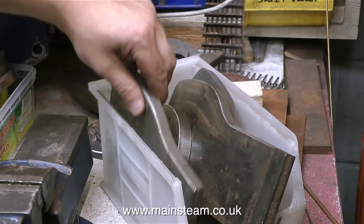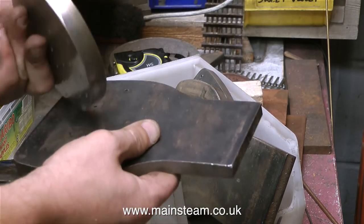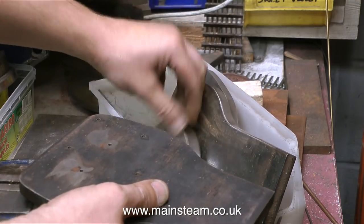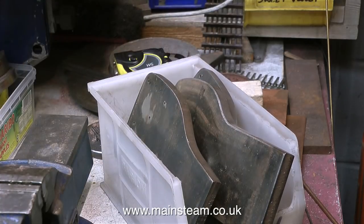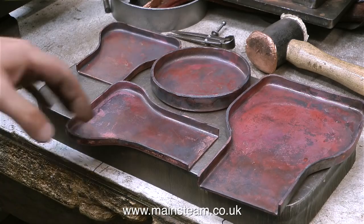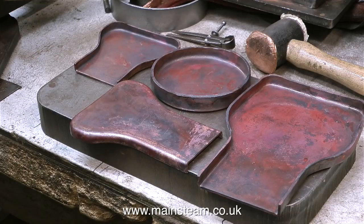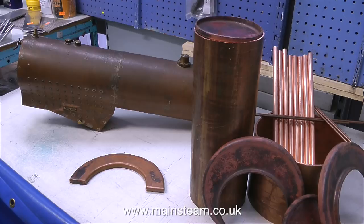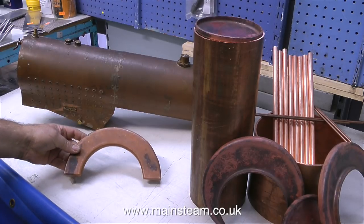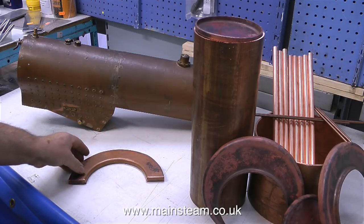Black Gates Engineering manufacture many different types of boiler kits. Here are one or two examples of the boiler formers that Black Gates use to make the boiler flange plates for different types of boilers. The holes in these formers are for drilling through to spot-mark where the tubes go. Here are some flanged boiler plates made using those formers — the holes haven't been spotted yet and they haven't been in the acid bath to clean them up. It's worth mentioning that Black Gates also have flange plates for the front and rear of miniature locomotive saddle tanks.